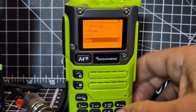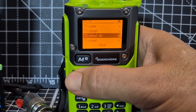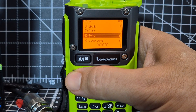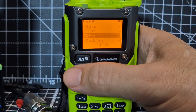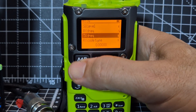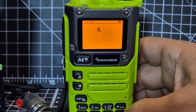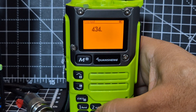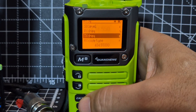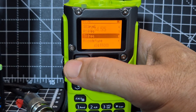In this window you can press F and when you scroll up and down you can put in everything. Say you're going to set up a repeater — you can put in your TX frequency. Let's go menu, and we'll go four three four five five zero, enter.